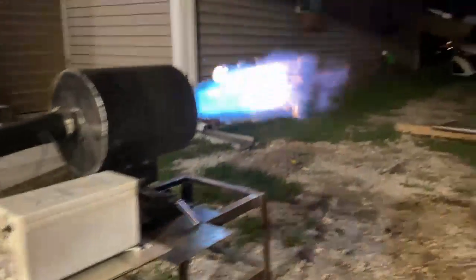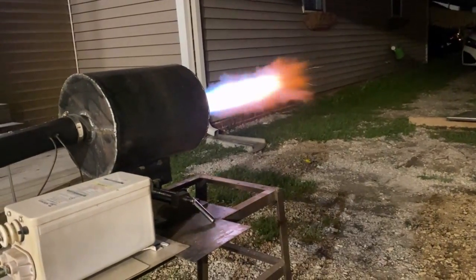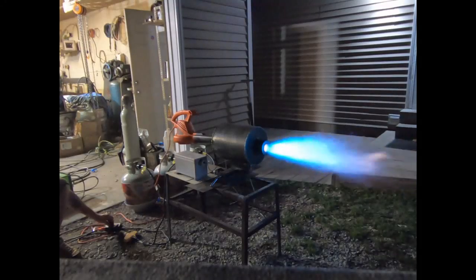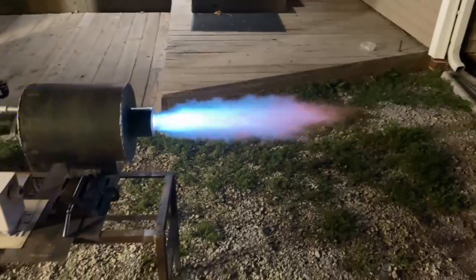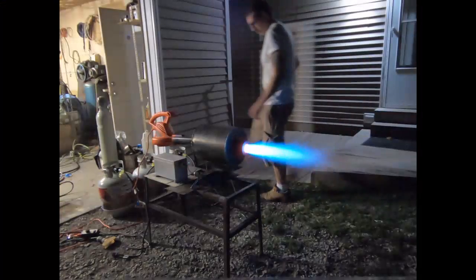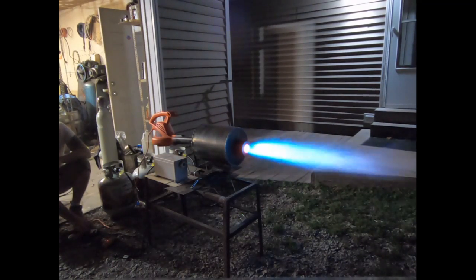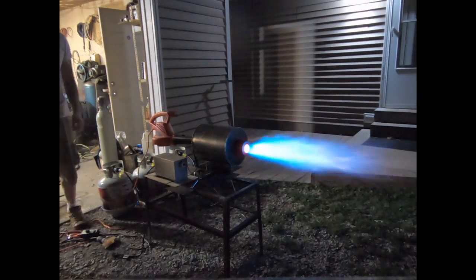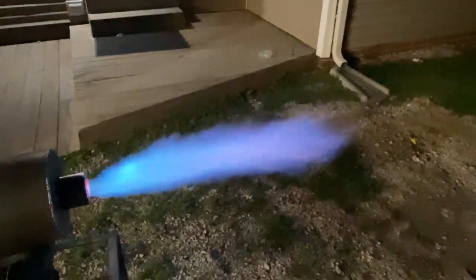The way this burner is going to be actually run, it'll be functioning as a pre-burner, kind of like right here, where a majority of combustion takes place outside the combustion chamber — we just need a mechanism to maintain stable combustion. Usually they use the geometry of the combustion zone to take advantage of Bernoulli's principle in a self-aspirated system, but we don't have the pressure available to do that with natural gas. You cannot siphon air in with an atomizer at 2 psi — Bernoulli's principle doesn't work at those low velocities and pressures.